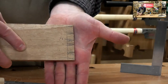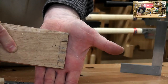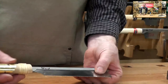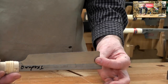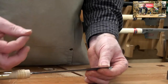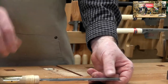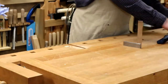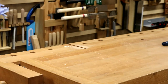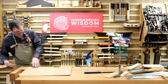We're actually getting, I don't know if you can really see the cut, a nice, clean, but very thin cut. So we're setting out a thinner section. The thinnest saw, this will be one, has a blade thickness of 0.3 of a millimetre. Wow. So that takes a lot less effort. It's removing less material, so I don't need to work as hard. Also means I can be more accurate and cut dead on a line. So all those little things add up. Really good little saw. Okay. A Stuber saw, which is, again, a subheading of one of the rip saws in reality.